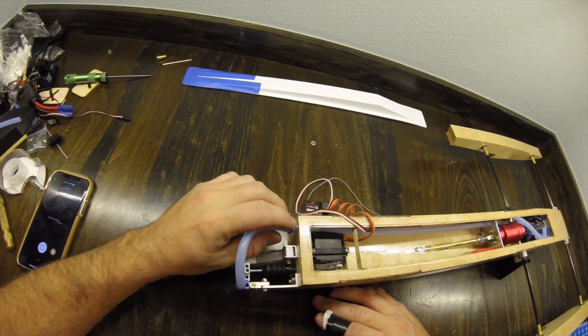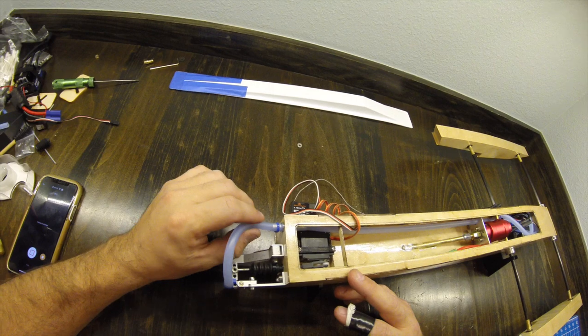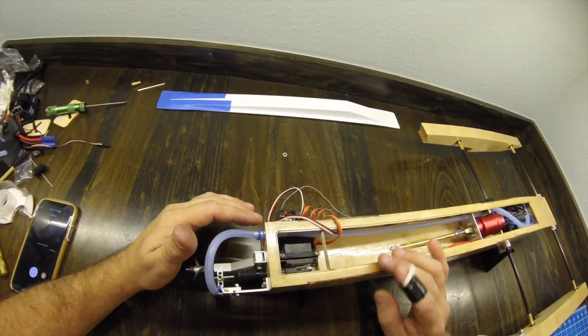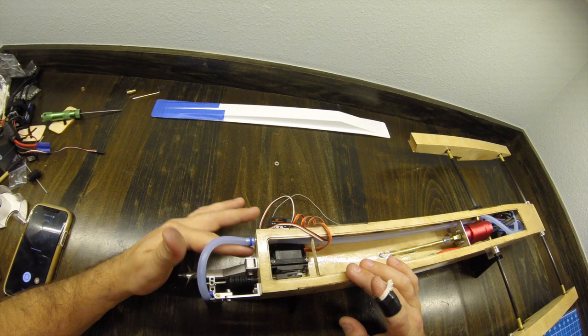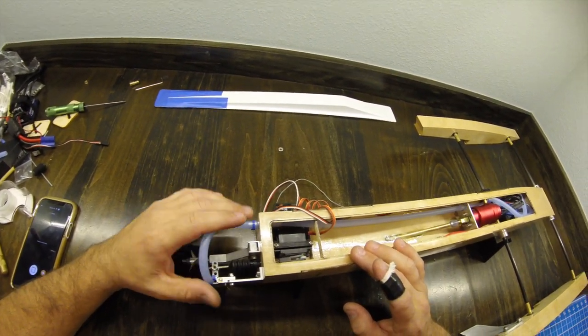plug the water outlet here. So they just usually have a hole here that the tubing goes in. I like to use the water fitting, so you can use brass tubing, or I had an extra fitting, so I ended up cutting a dowel rod plug, sealing it in there, and then re-drilling for it to fit this water fitting so that it's nice and clean.